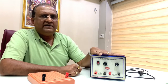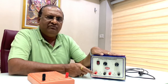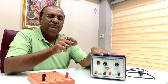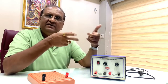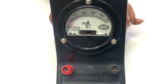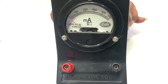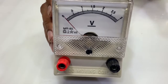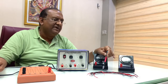Then the regulated power supply with output voltage 0 to 3 volt. Sometimes they can give you dry cells of 1.5 volt, and if we join two such cells in series, we will get DC output of 3 volt. Then the DC milliammeter with range 0 to 500 milliampere, the DC voltmeter with range 0 to 3 volt, and some wires to prepare the circuit.